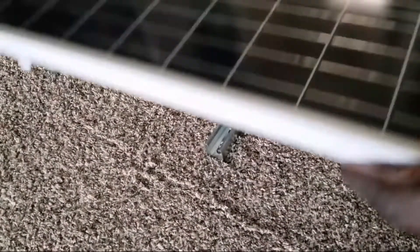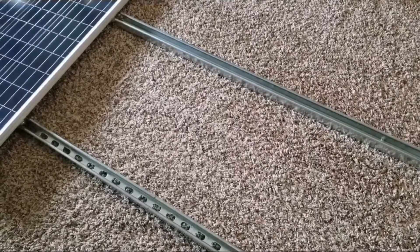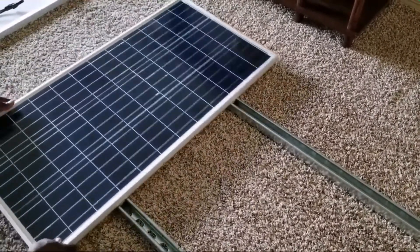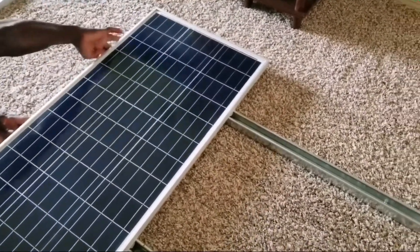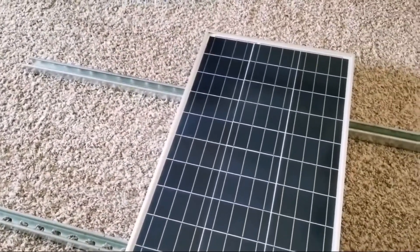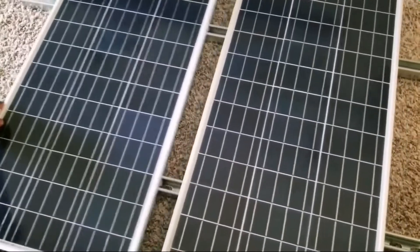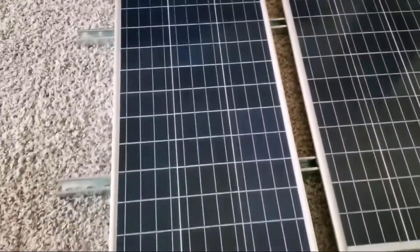The first panel is coming in and it's going to slide from this side. We're going to slide the panels — they're already parallel to the tracks. We're just going to slide these to see how easy it is. Make sure the last side hooks up to the other track here, and see the other side is there. Voila — one panel in. We're going to do the same thing again on the next module. The second panel is in. See how they glide? Really nice and smooth. As long as you get the rail tightened up and laid straight, that's how you mount solar panels on a Unistrut — the easiest way.